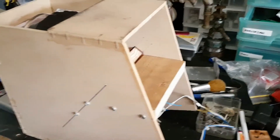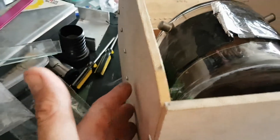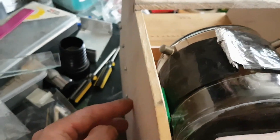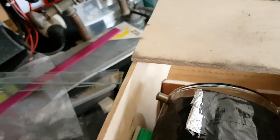Now I'm going to work out what kind of enclosure to put this cradle in. I thought maybe this enclosure here. I'm going to have it sitting in at one side because I want to attach the video board on the left side of the cradle, so that way I can have the target lead going as short a distance as possible to the input of the video board — hence less noise.